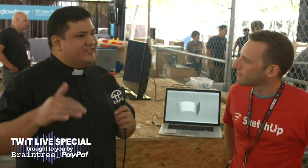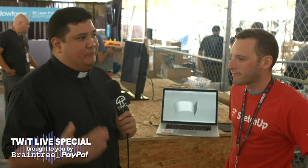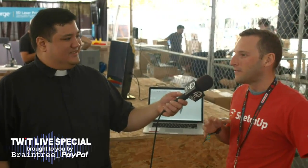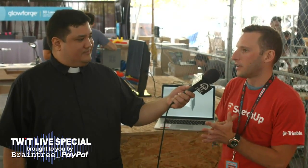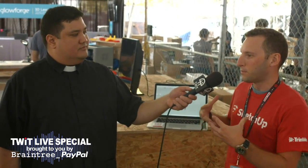Quick question. Is there a difference in how I design something that will be printed on a 3D printer versus, say, a CNC milling machine or a laser engraver? In other words, can I take one design and push it out to all my tools, or do I need to think tool specific? I'm sure you've heard this answer before, but it depends. But let me see if I can go to a broader level and give you guys something useful. When I design for 3D printing, I typically don't do it at scale, which means that I know the build plate dimensions, and at some point, if I'm going to print my object, I need to decide if it's going to be all on one build plate or if there needs to be connectors.